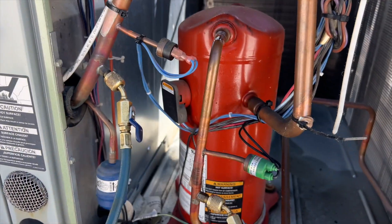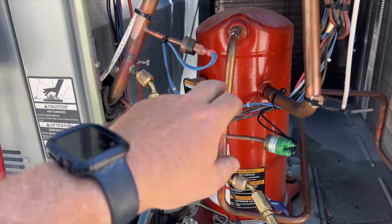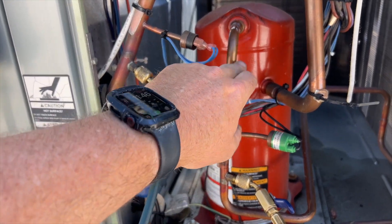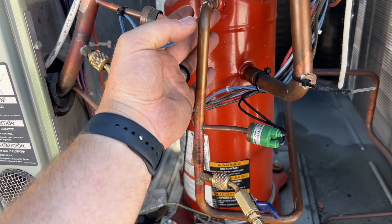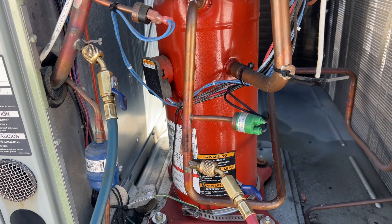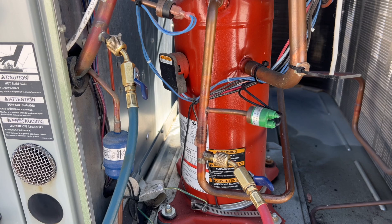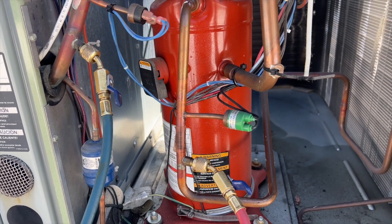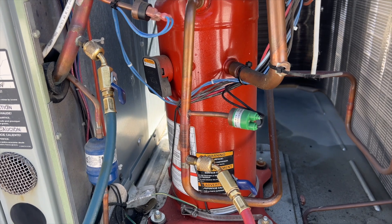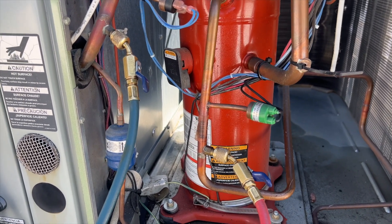Because it's on the discharge line, I'm tempted to just braze it up, but I'm actually going to cut this off and put a new piece on, just so I know it's solid — because this will probably just crack again. Looks like we found our leak, so we're going to dump the nitrogen and then braze that up and go from there.